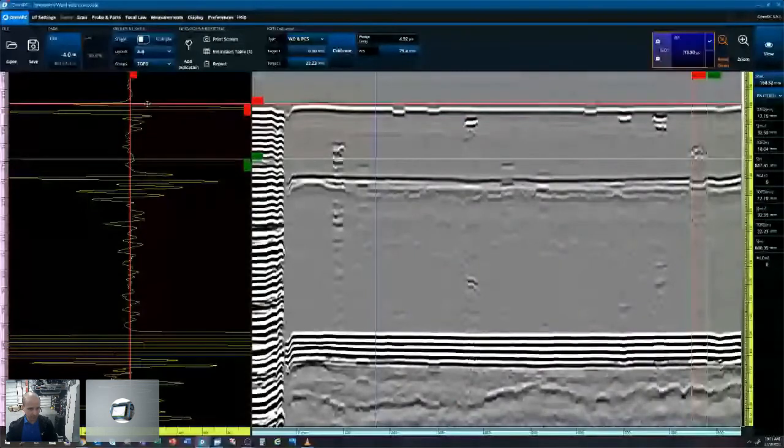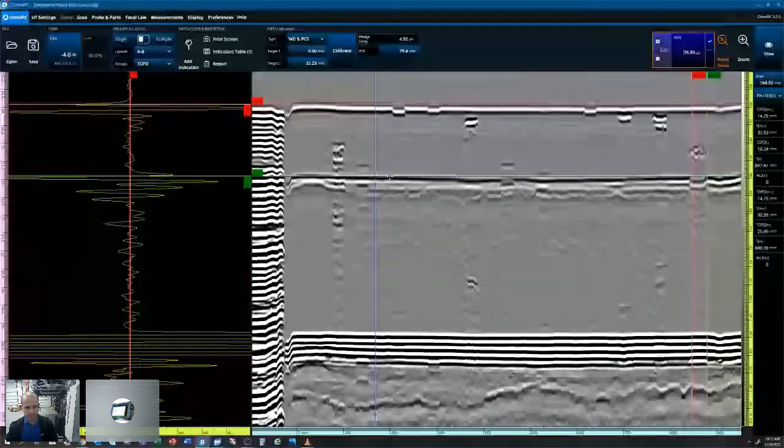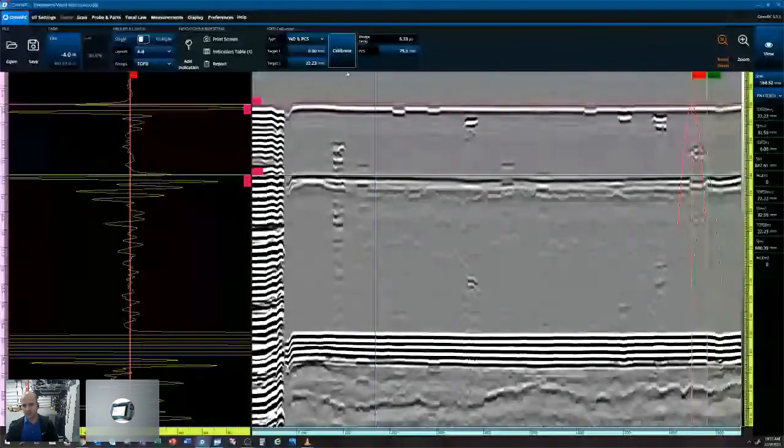You can see that our first negative signal on our lateral wave is at 13 microseconds. So we'll pull a clean area with no flaws, and we can just do a quick calibration. So we're going to do a wedge delay and PCS calibration. Target 1 is 0, so our reference cursor on our negative peak. And we'll set our reference cursor on our first positive on the back wall, sorry. And you can see we're at 13.9 and 15.8 once we hit calibrate. Now we have our time base calibrated 0 and 22.2. So then we can go through and process our data, do any sort of height sizing.